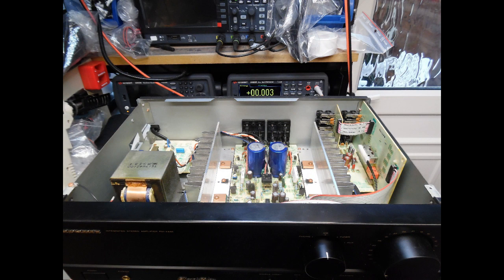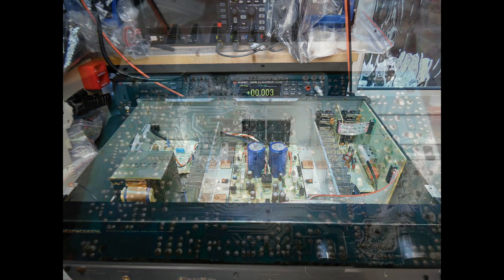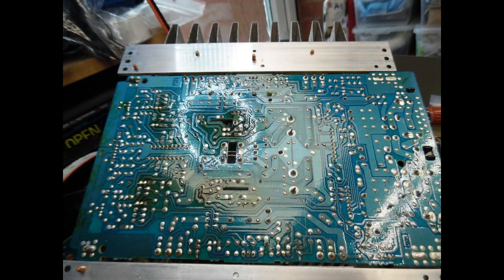On the bottom of these amplifiers there's a service plate, but you won't get full access through it. Looking from the top, there are four fixing screws and some metal tabs towards the front — use a long flat-blade screwdriver to push those out of the way. Squeeze the PCB mount with pliers and lift the board up. Shown in the video is also the most common fault: when manufactured, boards pass over a flow solder machine and flux coats the component pins.